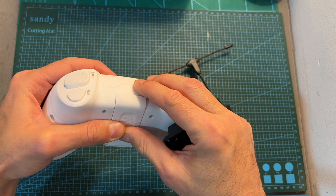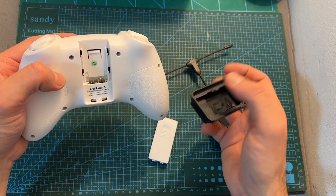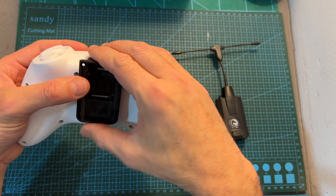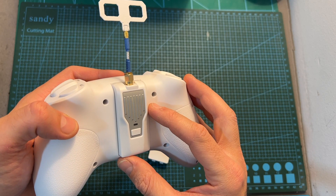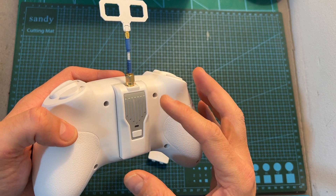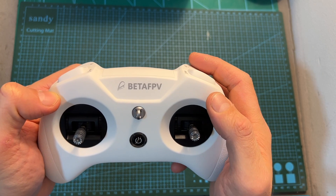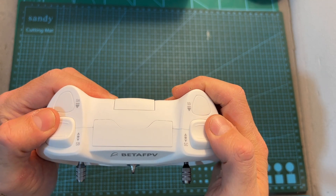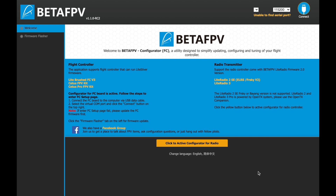On the back side of the radio controller you can find a nano module bay. It supports radio transmitters using the Crossfire protocol like the TBS Crossfire Nano — for that you'll need an adapter provided with the TBS Crossfire Nano transmitter — and you can also use it with ExpressLRS radio modules including the one by BetaFPV. Just like the previous models, the Light Radio 3 supports eight channels; in addition to the four main channels, on the top side you can find two three-position and two two-position switches. Configuring the Light Radio 3 and updating its firmware is done using the BetaFPV configurator tool, available for Mac and Windows.